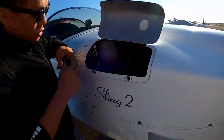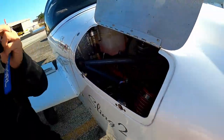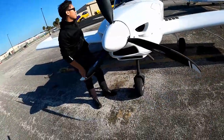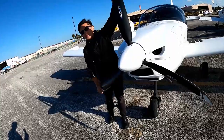Right here we have an individual oil tank, so just check the oil stick right here. It's a little low. The rotating propeller sends the oil back to the oil reservoir. Make sure your mags are off — we keep rotating until we hear the 'burp.'